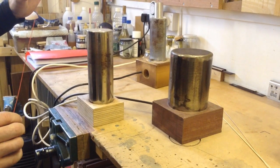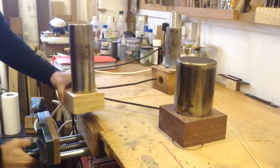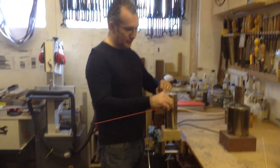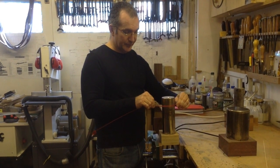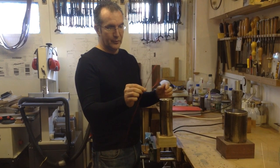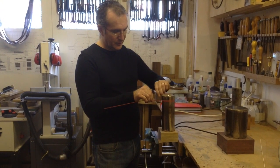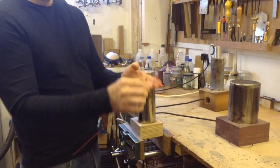So you can see you've got two different diameters here. This one is already quite warm, so I'm just going to put it on the device. And you can see that because it's a perfect cylinder, what will happen is that when you wrap the veneer around and just hold it there for a little bit — just to allow the heat to go in and take the shape — okay, so that should do. You can see you've got a perfect circle in the veneer.